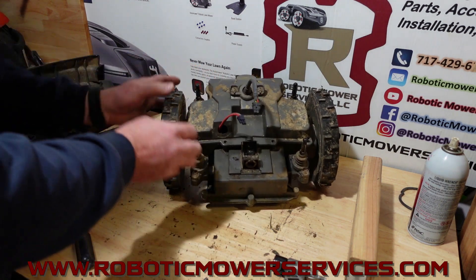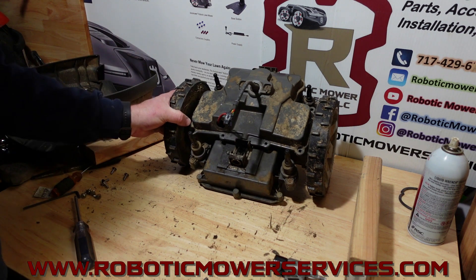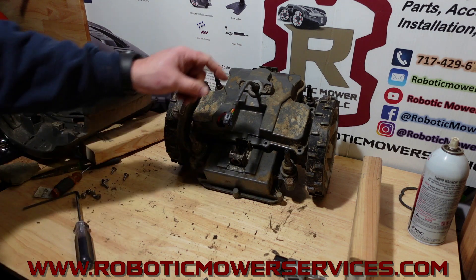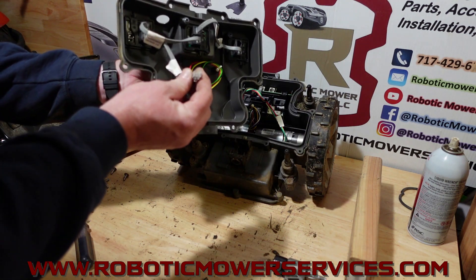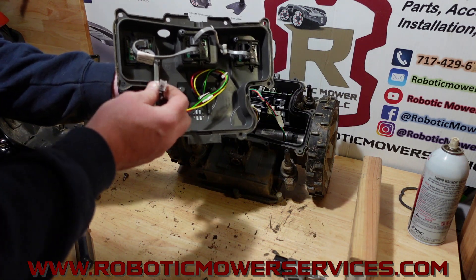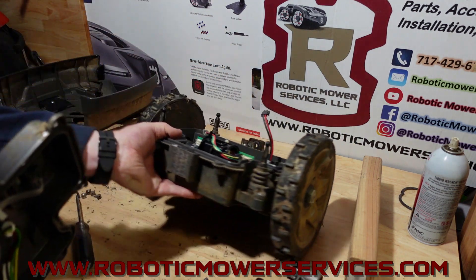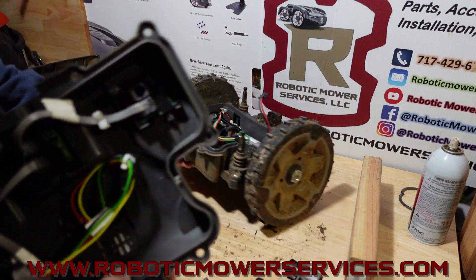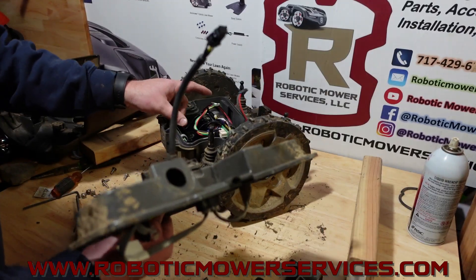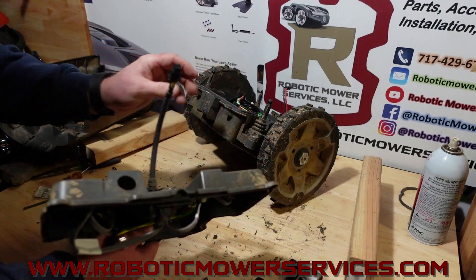The same nut and washer even though these are the smaller diameter wheels. The magnetic sensor boards — all three of them are the same, and the two in the front of the all-wheel drive AutoMower are the same as these. So you can move them around to figure out which one is bad, or rob one out of another AutoMower — they're all the same, so you don't have to worry about one being specific to outside, inside, front, or back.